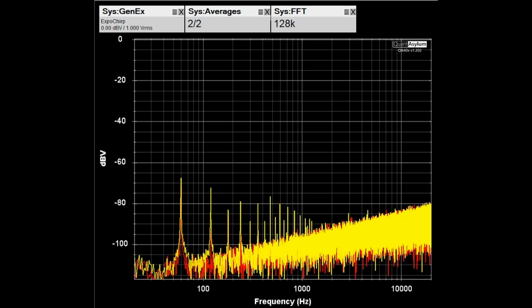All right, so our CD input has been selected and stabilized. And remember, we started off at 0, so our worst case input to input isolation would be about, we'll call it 67 dB right here. And that is mainly due to the 60 hertz power supply leakage. And then we have another big one here at 120. But if you start looking down at the mud here, at the noise in this level, at the worst case, it's minus 80 dB down for the most part, and then it gets kind of better. It's just your power supply noise is creeping up there. But that kind of just shows the input to input isolation. It doesn't specify what it should be. It's just kind of there for your reference only.